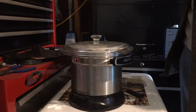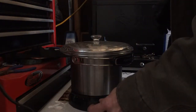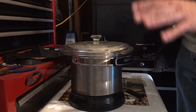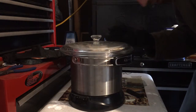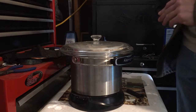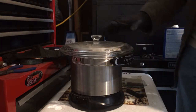Let it go for about 15 seconds, then give it another 5. Usually I might give it a third break — 15 seconds and then another 5 — but that's if I'm trying to get the vapor all the way to the top of the lid for a big part. This one's only a couple of inches high. Looking through the glass I can tell it's already hitting the top but not all the way, so I'll give it one more short burst of 3 to 5 seconds. For about a minute to a minute and a half total, I can now see the vaporization accumulating on the top of the lid — we have a full vapor cloud inside.